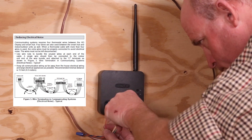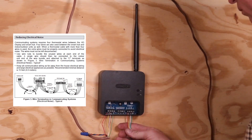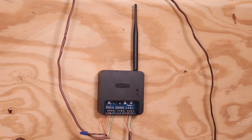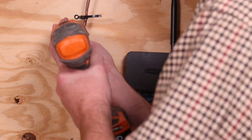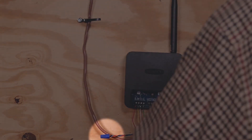Then connect the wires to the indoor unit at I positive, I negative, and C terminal block, using the same color code that we used in the display base. If you have extra wires, bundle those together and connect them back to C on your indoor unit.